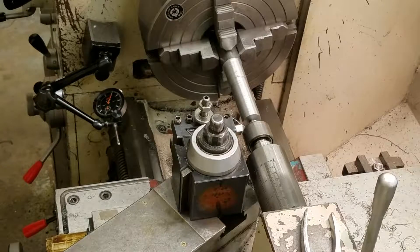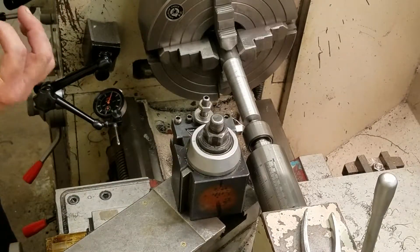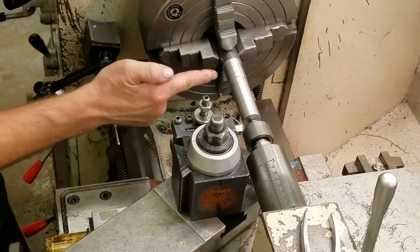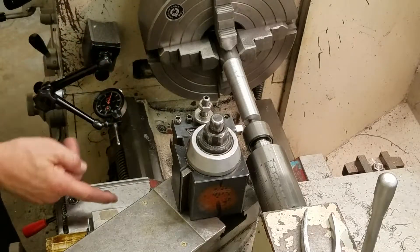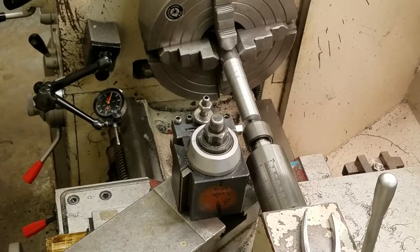That's what I want you to do on each of your steps. I'm going to make another video to show you more closely how we do this half-round bump for length. We could put marks on here, use Dykem, scribe lines — there are a lot of different ways to do it. But using the dial indicator on the headstock is the most efficient and most accurate way to get our length. If you have questions, send me a text or an email and I'll get back to you as soon as I can. Thank you for watching.